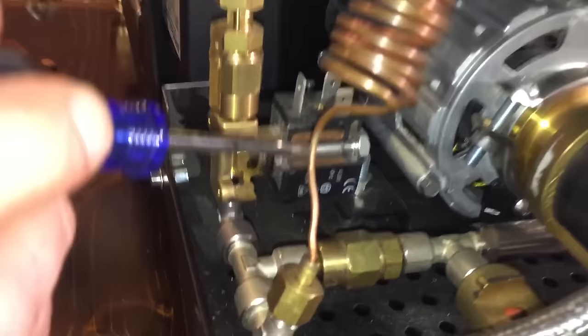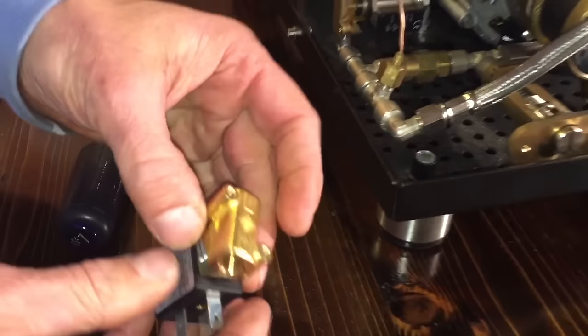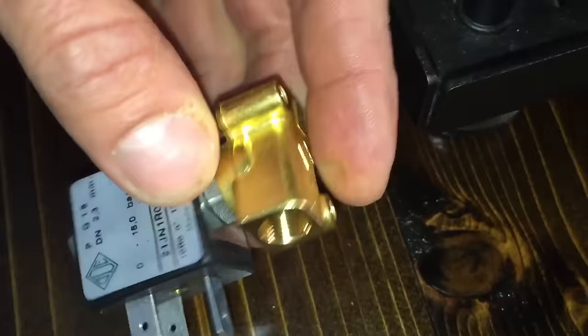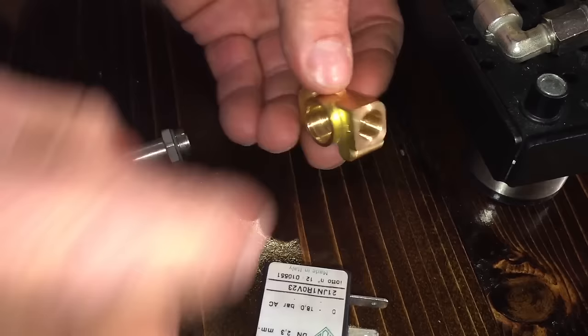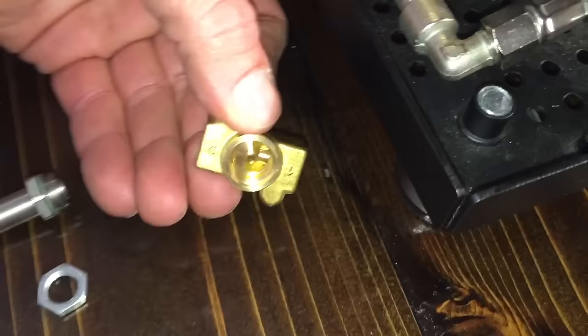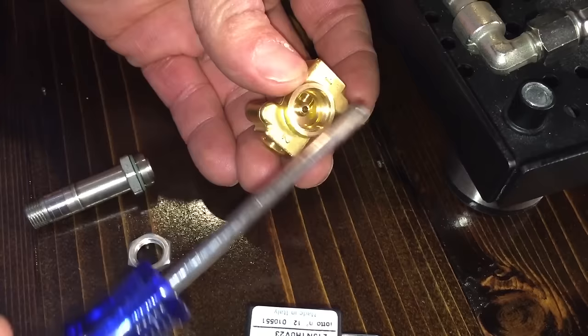In the cutaway here you can see there's a copper coil. This is basically a magnet that has a plunger in there. We'll pull this out and show you how that works. You'll see there's an arrow on there that shows where the water flow is. The water comes in this side, it goes up — see that opening there? When this valve opens, this port is open and the water comes out through here and out the other side. They do it this way because if the water came in through the other side, the pressure might actually push the valve open. That's why it's important to have it go the right direction.